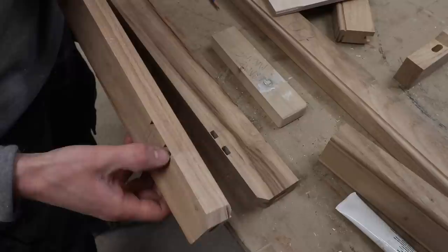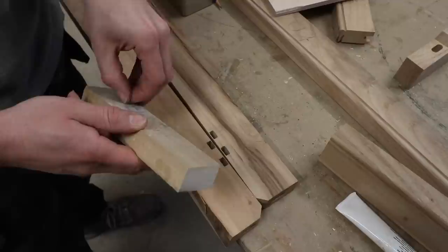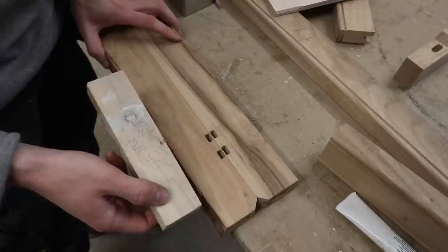So I'll put the magnets in now. I've got a little jig here which I've had since day one of doing these magnets. I've written on it frame magnet, so that is the polarity that the frame magnet will sit in. So every magnet I've ever set has been set off this jig. So if I ever had to replace a door or anything like that, I know exactly how the polarity of the magnet will be in that piece.